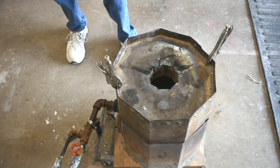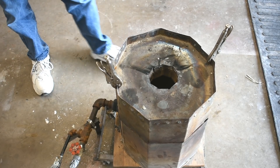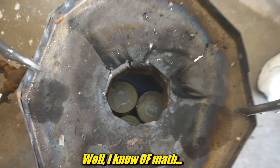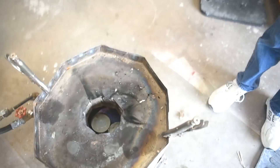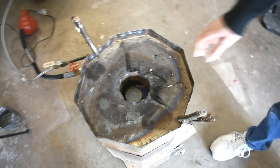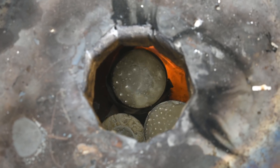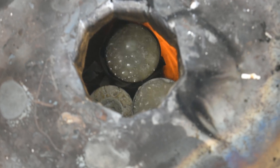The way I burn these out, I can fit three of them at a time in the furnace, and he had six. So we did two batches of three. I put the burner on as low as it would go — like, I can stick my hand right over the hole and it was mildly warm, but it wasn't burning hot. At some point it started kind of boiling — there was water you could see boiling. I probably should have had these upside down, but I really just didn't want the goop to melt into my furnace and burn out.